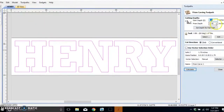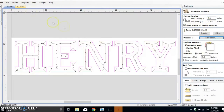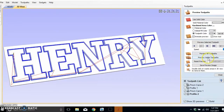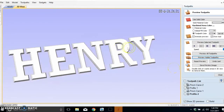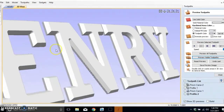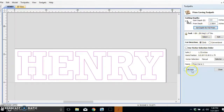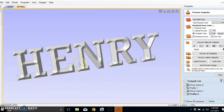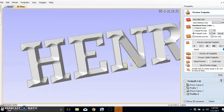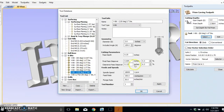I decided to use the prism toolpath function for cutting out my text. Essentially what it does is create a chamfer around the profile of your shape. I've done this manually in the past with a combination of settings, but what's cool about prism is if you want the top surface of your shape to come to a ridge where the slopes meet, it automatically calculates the depth of cut necessary to make that happen throughout the entire shape for the given angle of V-bit you're using. The end result is a nice effect, but I'm using it today to just shape the edges of my three-quarter inch thick letters.